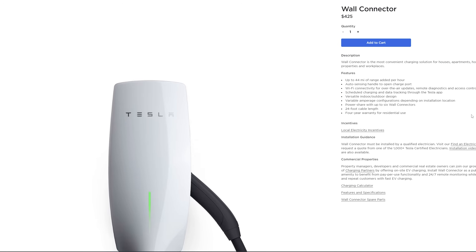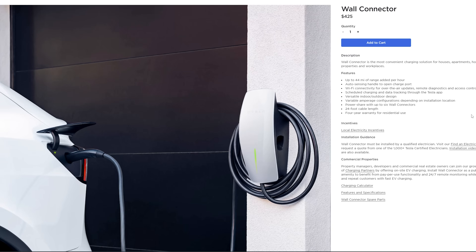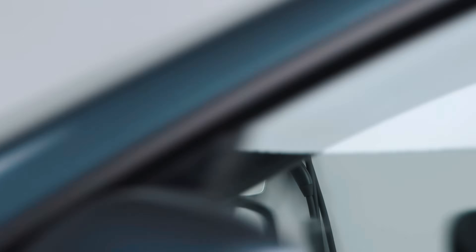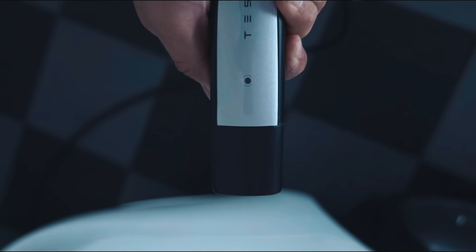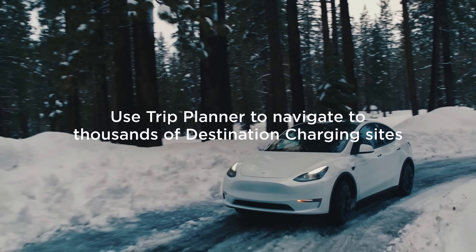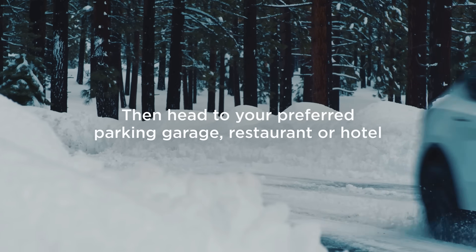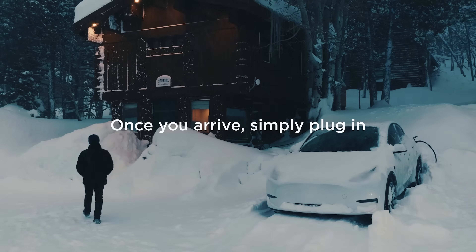This is going to be the Tesla Wall Connector. This is going to run you about $425 from Tesla — the price varies drastically, it's been as low as $350 and as high as $500-plus. Right now at the time of recording this video it's $425, plus the cost of install, which is going to be more expensive than a 14-50 because a 14-50 is just a simple plug getting put in. The Tesla Wall Connector has to be hardwired in. You used to be able to buy them and plug them into a 14-50, but they don't offer that anymore. Now, the wall connector can be put on as small as a 15-amp breaker, all the way up to 60. Assuming you are on a 60-amp breaker, you're going to be able to pull 48 amps, or about 44 miles per hour, which is zero to 100% in six to seven hours.